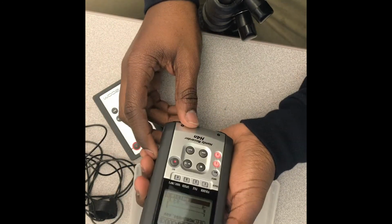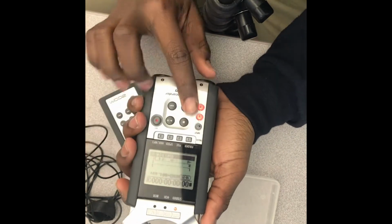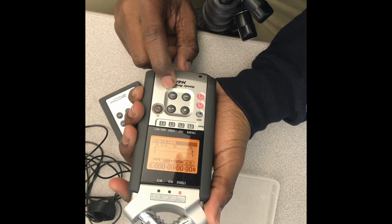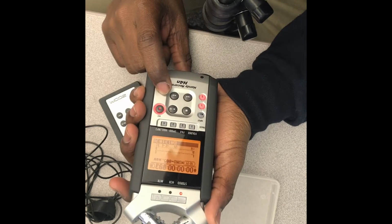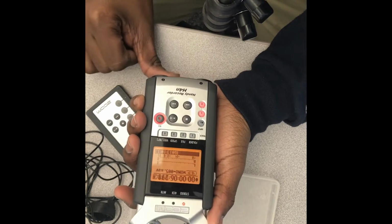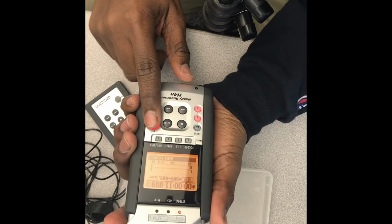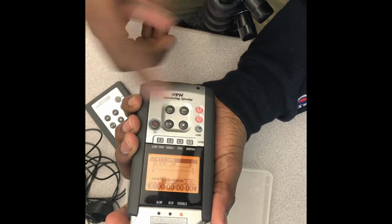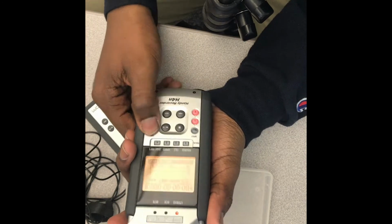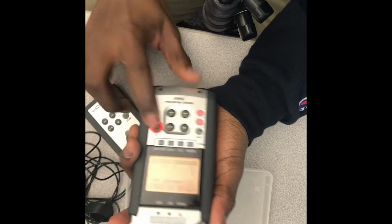So right now we have it open. It's on stereo, and the red light indicates that it's on stereo, and it's recording from 1 and 2. So if I were to press record right now, just to prime it, and press record again, it's recording dead silence. It's not recording my voice, it's not recording anything. It's recording these two, which is just dead silence. So I can press stop, and we'll stop recording. Now I can record again. It's primed. Press once to prime, press another one to actually start recording, and then pause.